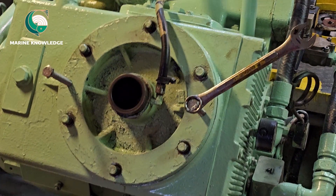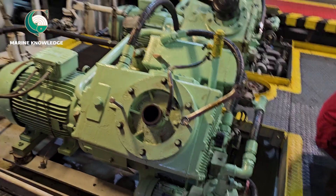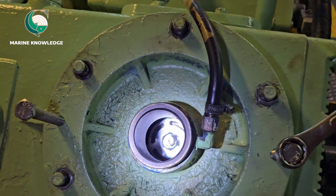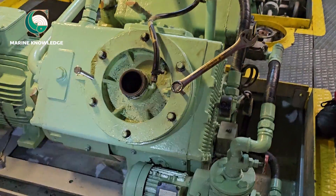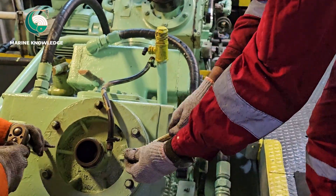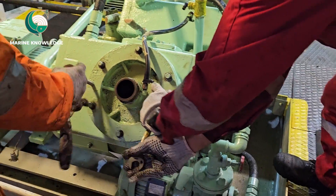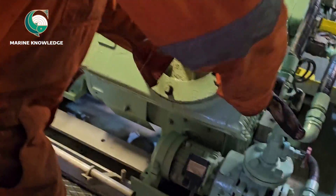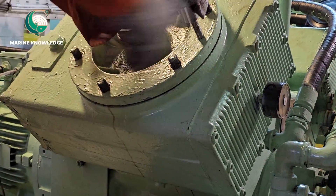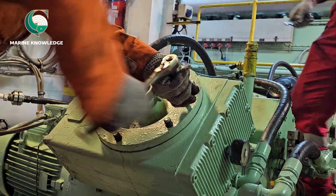You can also call it the liner for the valve. You can see and inspect the valve inside — that is the one we are going to remove and replace with a new one. The reason we are changing it is we are having low efficiency on the LP side: we are only getting less than 3 bar where we should be getting 5 bar.